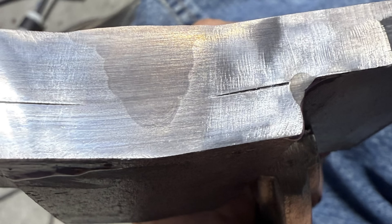Considering there are probably over 10 passes in this, the weld is overall very clean and looks pretty much perfect. I'm surprised at how much it bit into the backing strip — about a quarter inch or 6.5–7mm — it almost bit halfway through. What appears to be a lighter colored area where the plate seam is on the right side is not a lack of fusion or defect; in person it was perfectly clean. I don't see any of the original bevel edge left. Even the tack weld holding the backing strip looks really good — and remember, this is all at 130 amps.